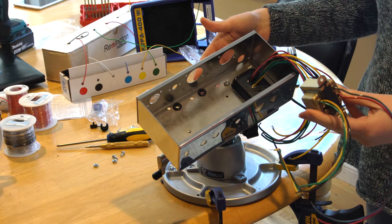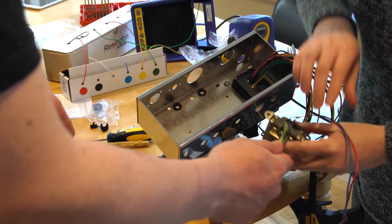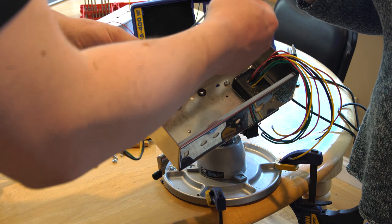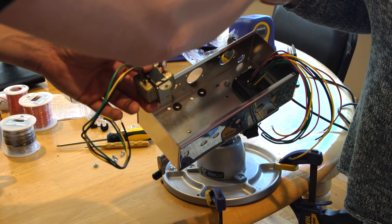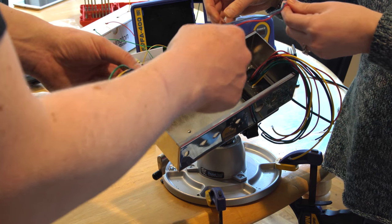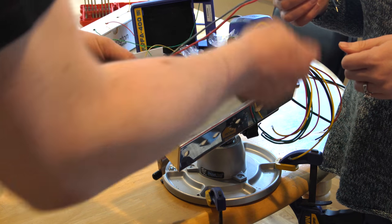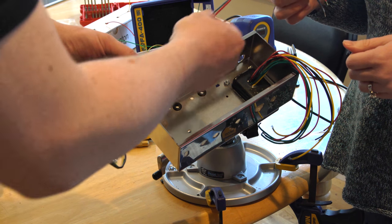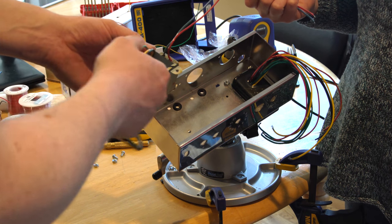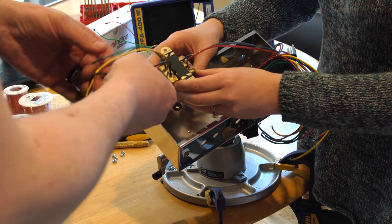So now my understanding is we want this oriented this way — the opposite way. There are two parts of the transformer: the primary and the secondary. The primary is this side and that's where the output tube connects in — one end goes to the output tube, the other goes to the high voltage or ground. We'll check the schematic. In a push-pull transformer you put one into each of the two power tube sides, but in this case it still goes to the output tube and runs power from the tube into the secondary.